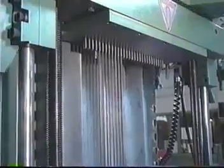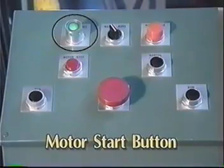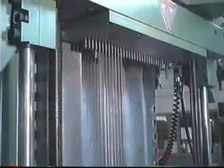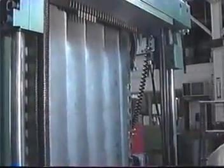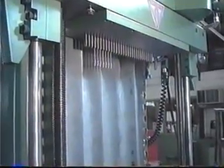Once a group of rods are pulled down, you can raise the RAM and remove the rods from the expander. Do this by first pressing the motor start button. Again, make sure it is in manual mode. Press the RAM up button until the ends of the rods are exposed. Remove the loose rods. Lower the RAM and repeat the process until all rods have been removed from the machine.